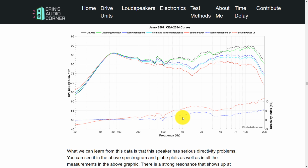The other issue with this particular speaker is that there are two 5-inch woofers, and that's also going to contribute to the pattern here, causing it to go up. Now that's more so vertically, but I believe that that's also an influencer here. Not a huge influencer though. So you see the directivity is increasing up again because the woofer is likely beaming, and then it dips back down. Well, this tells you that this is probably the area where the tweeter is crossed over.